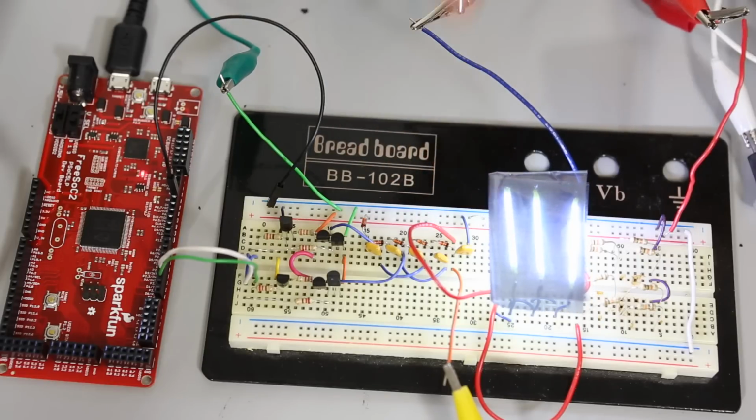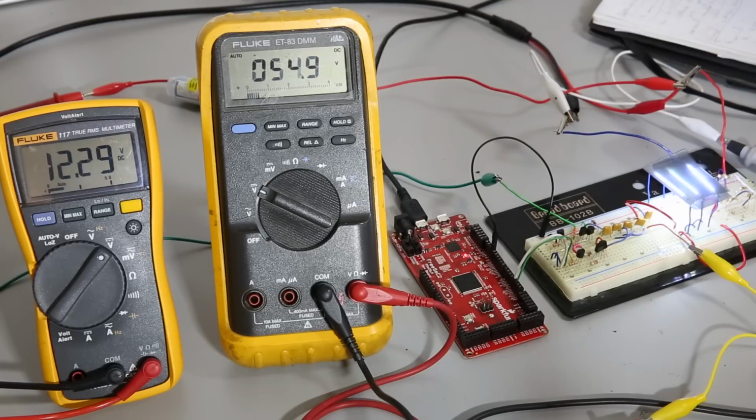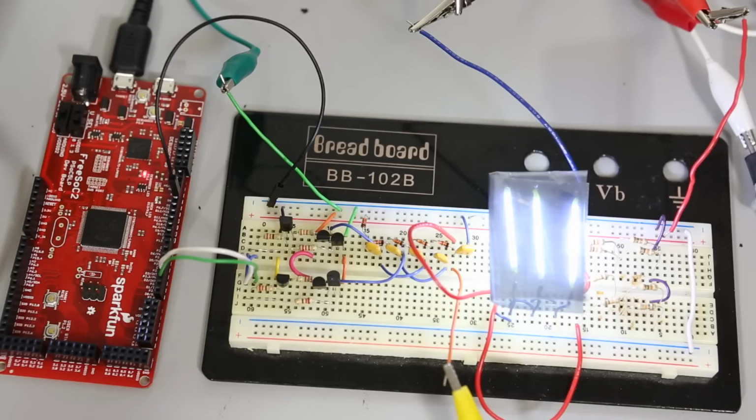As this thing sits currently, I am drawing about 14.3 milliamps out of this thing with 73.2 going in, which gives me, remember efficiency, power out over power in, right? That's what it is. And I'm running at about 87% efficiency with this circuit as it stands.